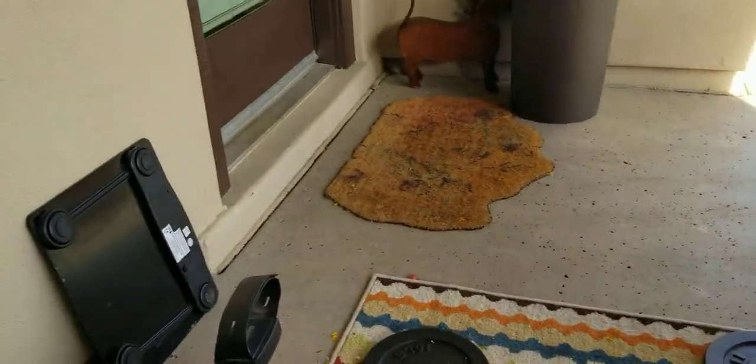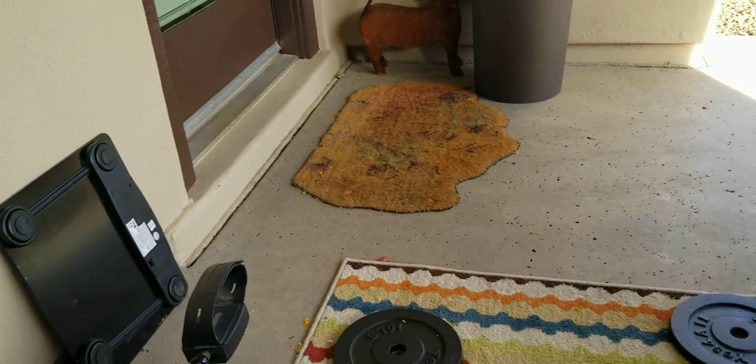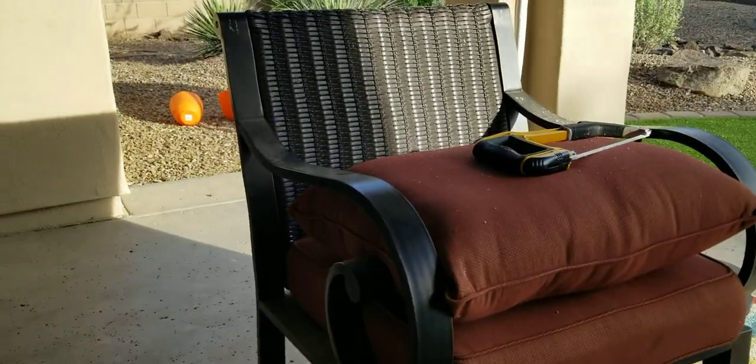I put the PVC under that little lip there next to the scale and leaned it up against the chair here to cut it. And that's probably why it was a bit crooked and a little bit pointed. So I need to figure out a way to get it to be flush and flat with the cut. So maybe a miter saw would be best. So I'll have to go and look into a miter saw.